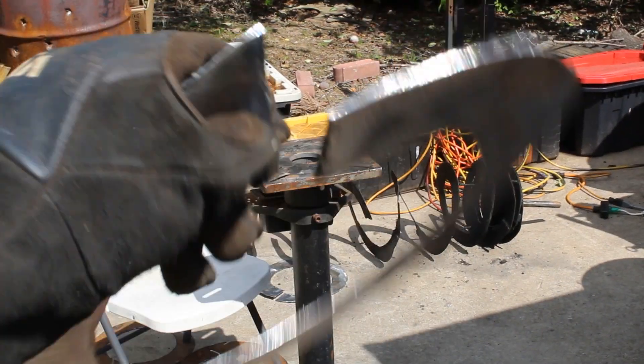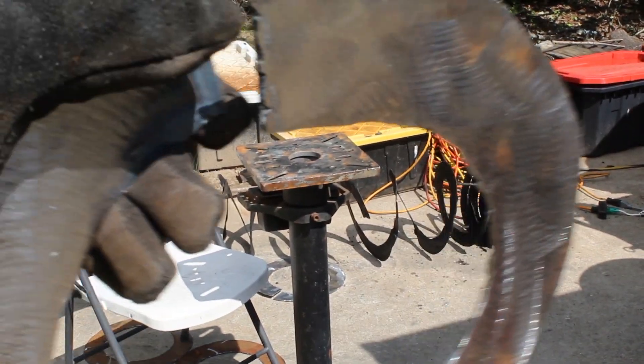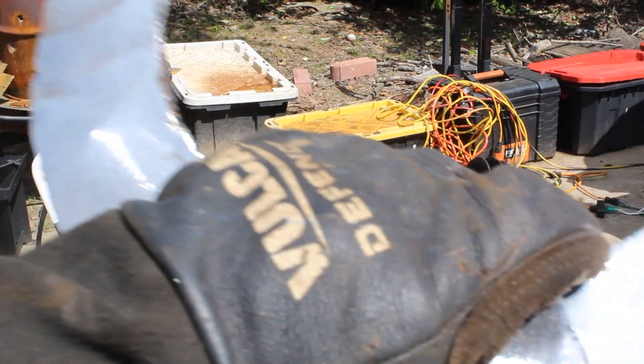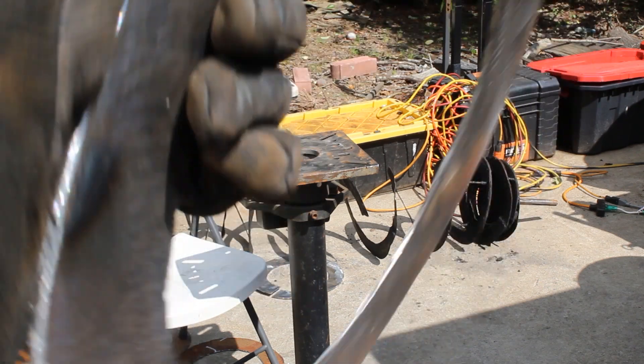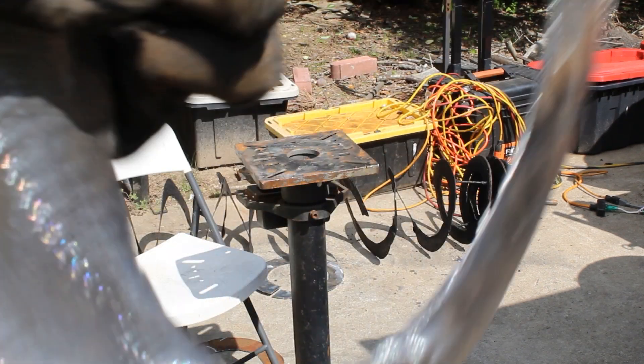So both of them have been cut out and ground down. Now it's very important that they're ground down, because if there's any sharp edges on there, it's going to end up being an antenna for the microwaves to actually come out and form plasma. And the issue with that is that it's going to actually waste a lot of the microwave energy that would have otherwise gone to heating up the plastics.